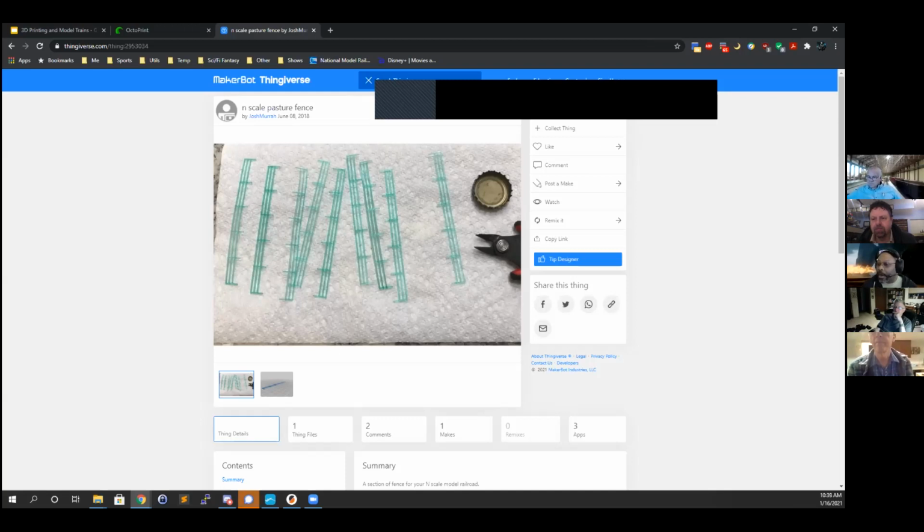Well, if you had the drawings, or if you could give that to somebody who's skilled in CAD, they could take the measurements and put together a CAD drawing. And then once that exists, they could save it as an STL, and that could get sent to a printer and it would be printed. There's a bunch of printing services online where you give them the drawing and they will estimate how long it'll take to print and how much they'll charge you for it. And there's a bunch of them out there.